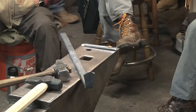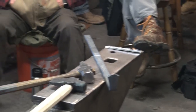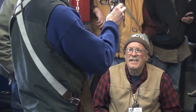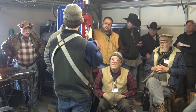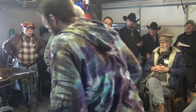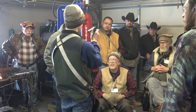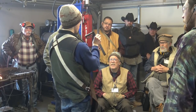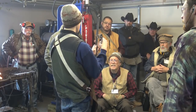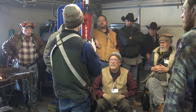If you look closely at that leg that we already finished, this top hole and bottom hole are slightly different in that if you look from the side here, there's more material on the bottom on this side of the top hole. That's because we punched from one side, and so all the material that it pushed swelled out at the bottom, and then we sheared out the slug. You never take out the same amount of material of the bar thickness. The extra material got pushed to the bottom, whereas this bottom hole is a little more even in cross section than the top and looks nicer, and that's because we punched from both sides. So we're going to try and do all of our punching from both sides to just get a little bit more even look to the hole.